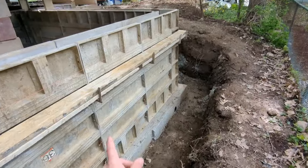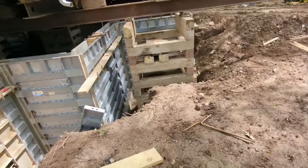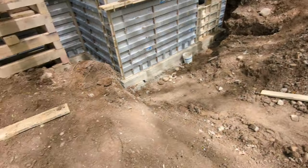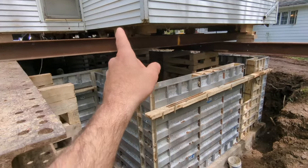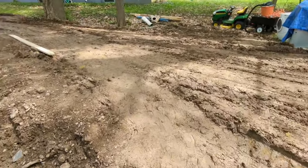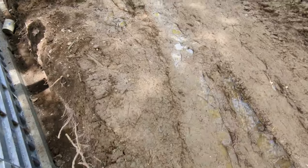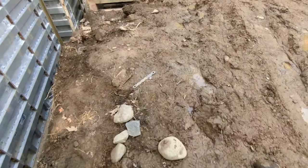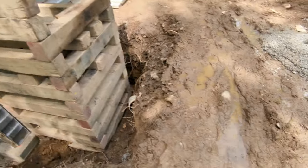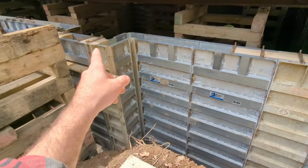Getting down to being ready for concrete — they've got 2x6 fortifying the wall at the top with what look like steel ties coming out. All our window openings coordinate to our beams. You could have just a pocket everywhere and fill it with block if you didn't want windows, or try to cut your steel custom to reduce the number of openings — but that's asking somebody to cut their steel inventory, which is just more expensive than borrowing standard lengths for the sake of the project.